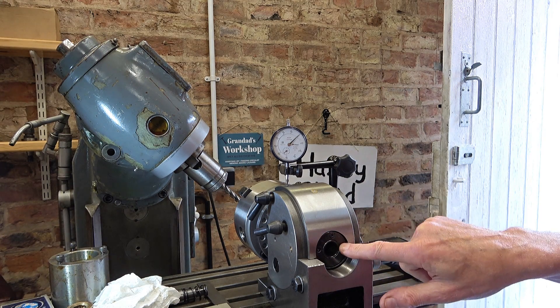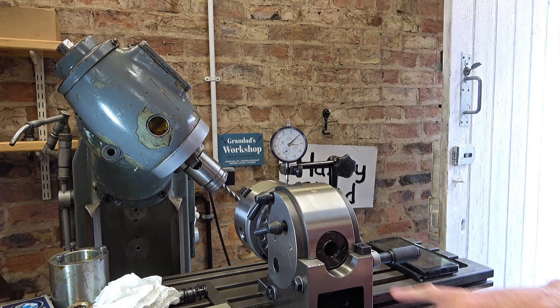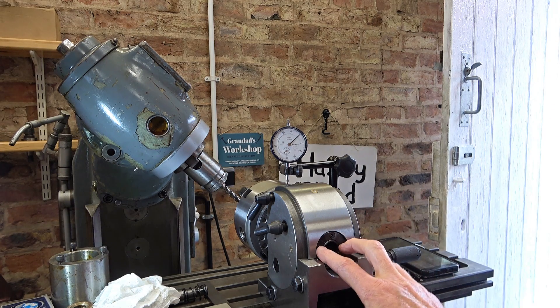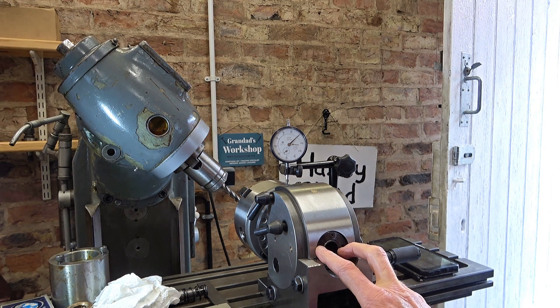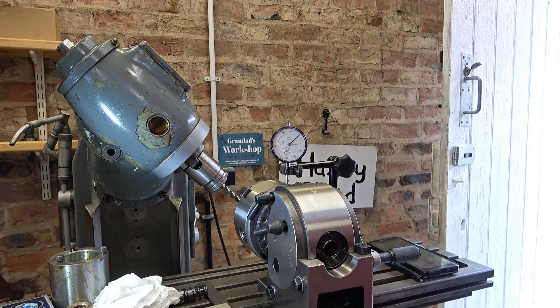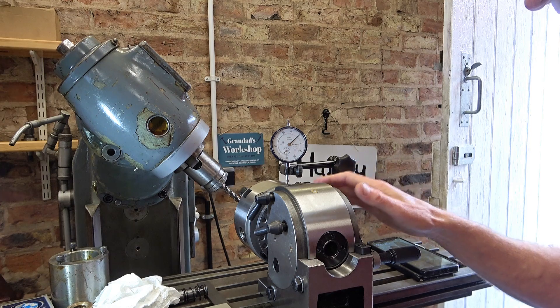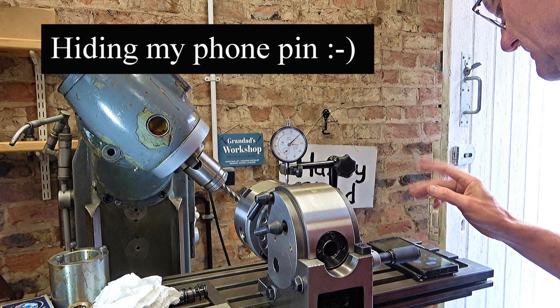In the back there's a bearing here and one at the front - there's a crosshead locking screw and if you unscrew that you could tighten the bearing. I'm very reluctant to do it since I hope it's been preset at the factory. I think that puts to bed the concern about movement when rotating and locking. The chuck body seems to be concentric and I'm no longer concerned about the run-out.